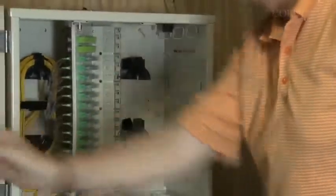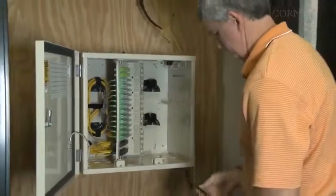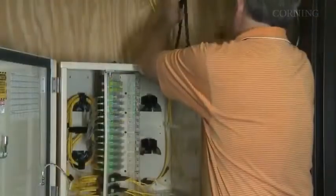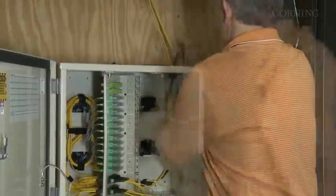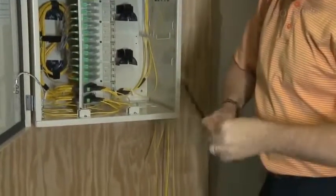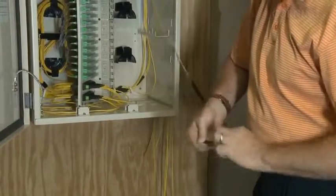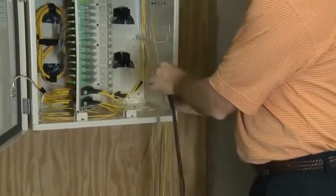Open the CE cabinet, unclip the cable from the black pull line, and feed the cable through your top right entry port. Using our standard recommended procedure 004-175 as a guide, remove the pulling grip to expose the MTP connectors on the end of the cable.